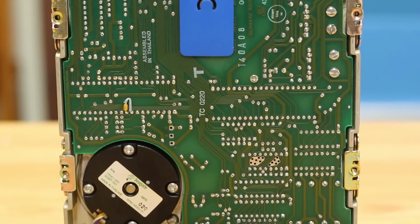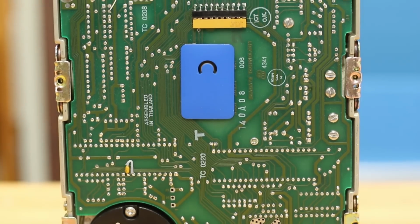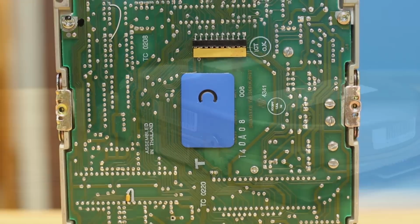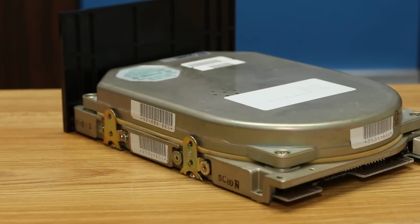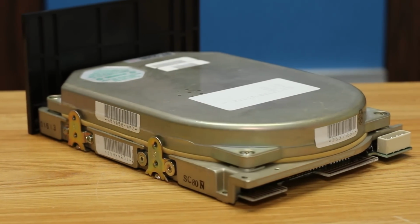However, the drive that's in it should, if it's still good, have some very specific EDS software or maybe even Centurion software on it. So I really want to try and save that if there is anything on there. But there's really only one way to find out, and that's to try and actually image the drive. Now, because it's RLL, I'm not sure how to do that.